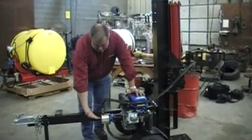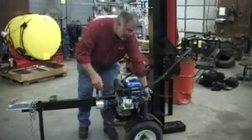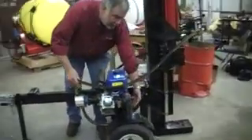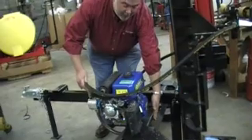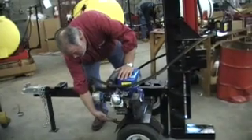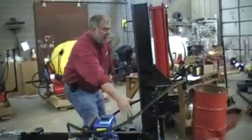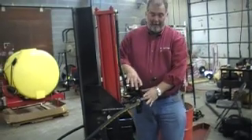Here's what happens. As you can see, follow my hand down — the hydraulic reservoir for this particular unit is located above the axle. Just a rectangular tubing, coming right down here. This long rectangular tubing is the reservoir. When the engine starts and the pump starts working, it pulls the fluid from that reservoir into the pump, pushes the fluid out, follows this hose, and comes into this hydraulic valve.